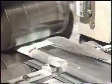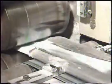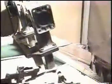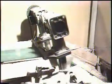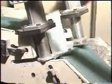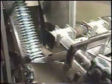The trimmed and shaped diaper will be folded by the folding bar and pressed solidly by the pressing wheel. Then the PLC-controlled blade will cut off the diaper at the precise location, following exact intervals between diapers. The cut-off diapers are then folded, and the defective diapers are discarded based on a memory base by the PLC.